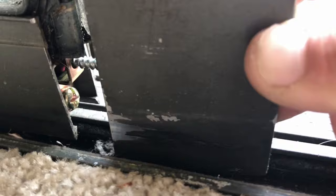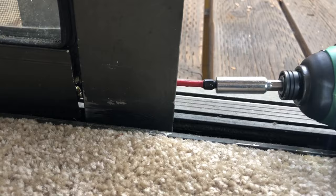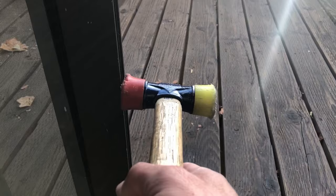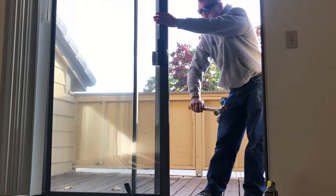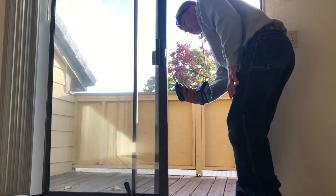You can guide the screw through the frame and get it started before hitting the frame back on. Take your rubber mallet and gently hit the frame back on — try not to bend it. If you don't have a rubber mallet, use a regular hammer but make sure you put a piece of wood or some sort of block so you're not hitting metal on metal. Go ahead and tighten your screws.